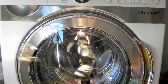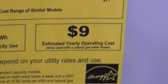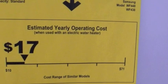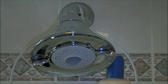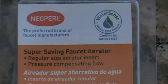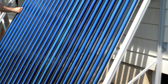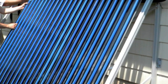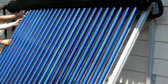The other critical point is conservation. Reduce your demand before you create and design a system. Make sure all your appliances and electronics use energy and water wisely. Change your shower heads to low flow — here we went from 3 gallons per minute to 1.5. We replaced all the aerators for all the faucets to 1 gallon per minute. And in one day, we reduced our hot water needs by 50%. This is why when most solar thermal companies suggest you could reduce demand by 50% to 80%, I think I can do better, since we've drastically reduced the amount of hot water we need to begin with.